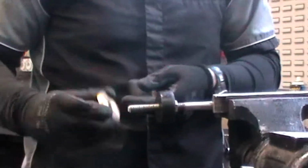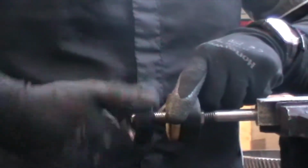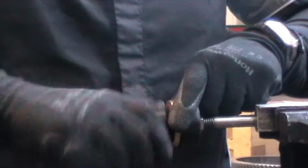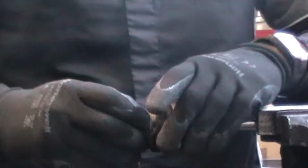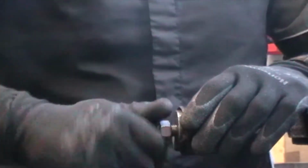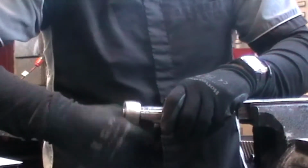We take the plunger center. It slides on there. Now, the other new cup. Wind that on. Then the other plunger end locks in. Now, check your plunger nuts. It's going to wind on there. Now I'll use a trusty socket set to wind everything nice and tight.